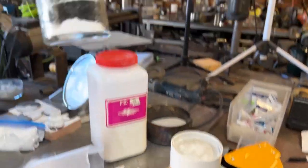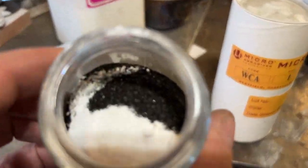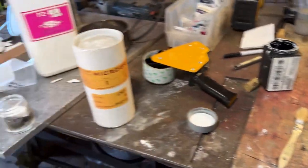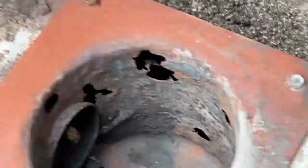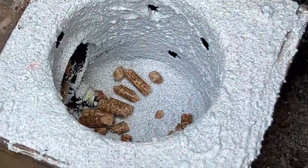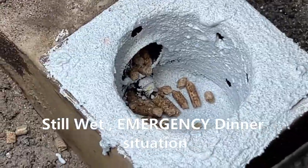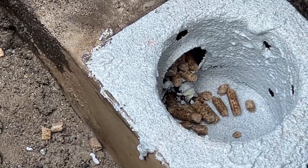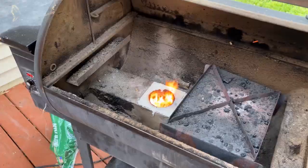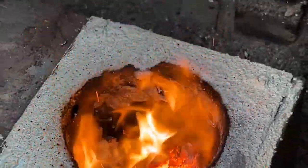We're going to attempt to make a quick fire patch. You can see how much of that black sand I put in there — that's a black abrasive blasting media — and we're going to top that off with some water glass. Here it is — it's got some massive holes where there shouldn't be, and it's almost ready for a new cup, but we ain't gonna do all that. I'm worried I might have covered the igniter, so it may have a hard start situation. I'm going for about 10 minutes and it looks really good. Let's just go ahead and do a full cycle.